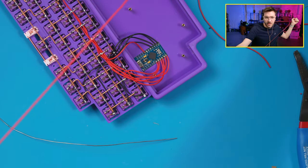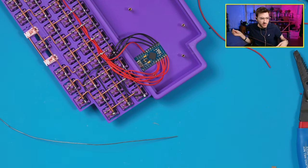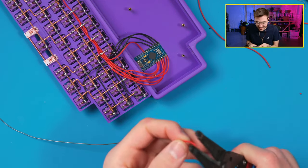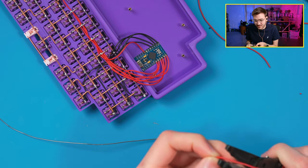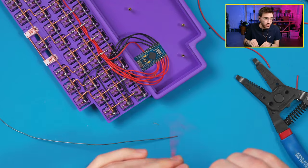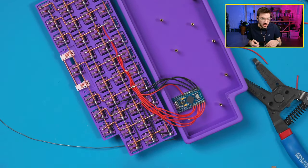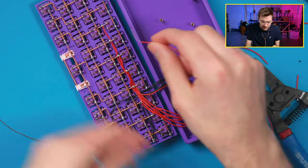As we get further away, we need longer and longer strands of wire. I've cooked a PCB with 350C before when soldering a power switch. Let me guess, you ripped off some pads? Is that what you did? When you're doing PCBs, that's something you have to worry about. You don't have to worry about that with hand wire, because you're dealing with just copper here, so you're not going to damage anything too much. You can melt some housings, so you always have to be careful of that one.